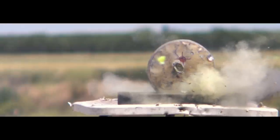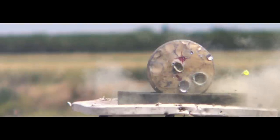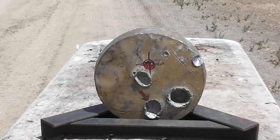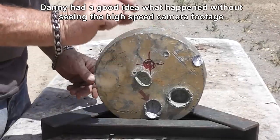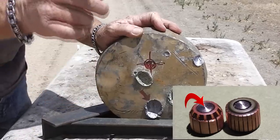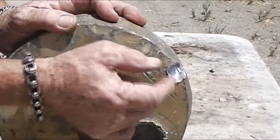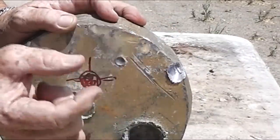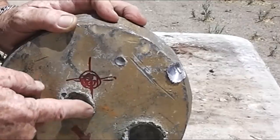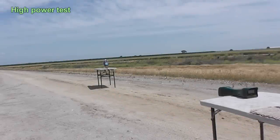During these tests we have no idea what's really going on — we have to guess and look at the damage on the plate to determine what happened. Evidently the thing came apart. The little steel center core — the shaft of the commutator — came apart. The shaft hit sideways; you can see the contour at the bottom where it hit, and then the major body of the commutator hit right here sideways. So it came apart in flight.